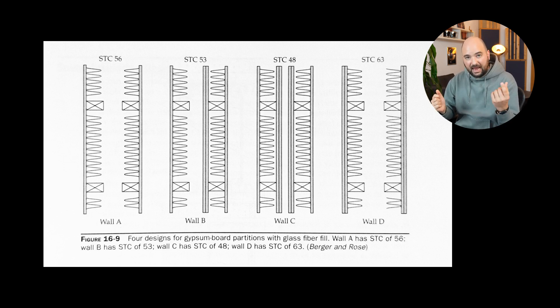If you build your entire room like this — all the walls, maybe on a concrete floor, with the ceiling as well, and seal the edges with silicone sealant — you end up with an airtight structure with very heavy mass walls. That's what gives you the isolating properties. Note that in this design there is no insulation material visible from inside the room — it's all hidden inside the walls. All you see is a heavy-duty, flat, reflective surface. So a room like this is very well isolated and soundproofed, but it has zero acoustic treatment — it's going to sound terrible inside. It's only now that we start thinking about acoustic treatment, and that's where all the standard stuff applies: finding your low-end sweet spot for your listening position, porous absorber bass traps in the corners, reflection points, and all that. That all happens separately once the actual isolating room is built. As acousticians, we separate these two tasks into separate planning stages because they require very different approaches and materials.